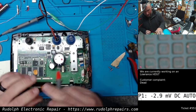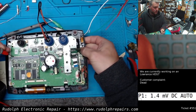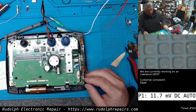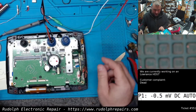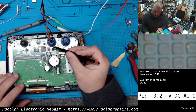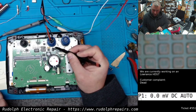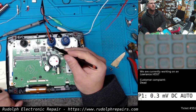We can check it with the card in — it doesn't really matter — we're still going to get zero volts. So what controls the 5-volt supply coming to the CPU card? From all the research we've done and other units we've worked on, we've found that these two chips right here — I believe one of them is a buck converter — and that drops the voltage down to 5 volts for the CPU card.